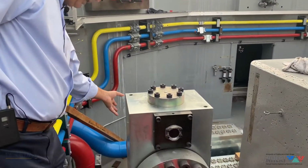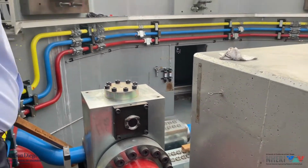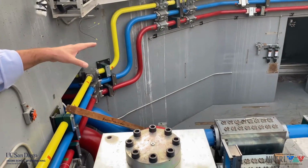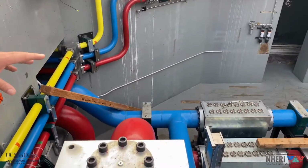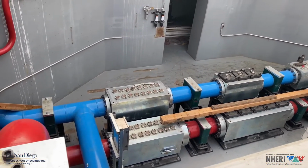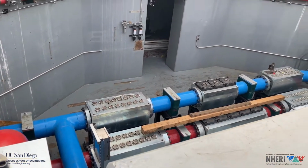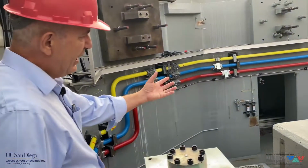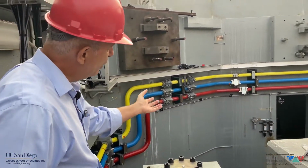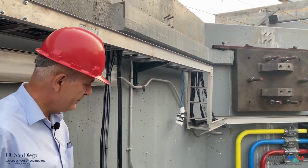You can see here many of these large blocks called hydraulic manifolds. And at the bottom again, you can see now closer than before, the red and the blue pipes, and these large blocks with 3, 4, 5, 6, 8, 16. Each of them has 16 orifices, and these will allow flexible hoses to bring the high pressure fluids to the servo valve of the horizontal actuators and get the return.